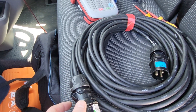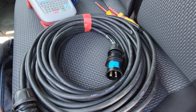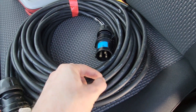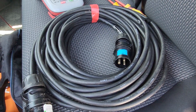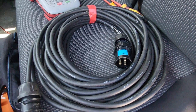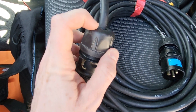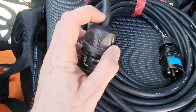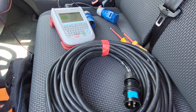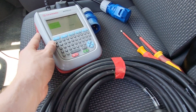Other connectors will have screws inside or screws on the outside — check that they haven't gone rusty and compromised the screw. Once you've done your full visual check, check there's no damage to your cable as well — no nicks or damage from being run over by a car or a tractor in a field. That's the most common thing. The other common thing is these connectors will become loose and the outer sheath will pull out, leaving exposed inner cores at each end. Those are the main things to look out for. Then when you're running it through your machine, you do it exactly the same as an extension lead.